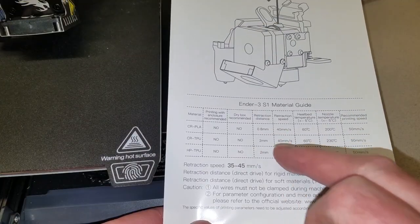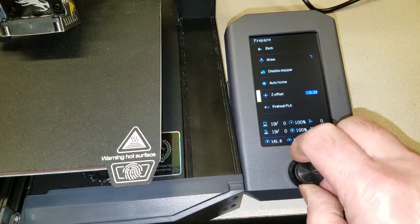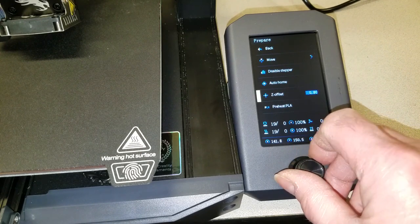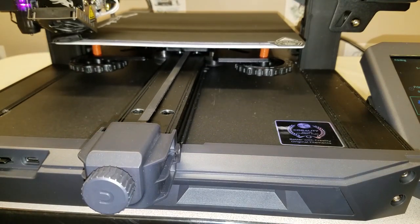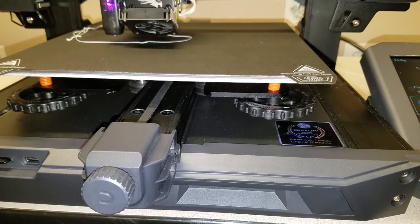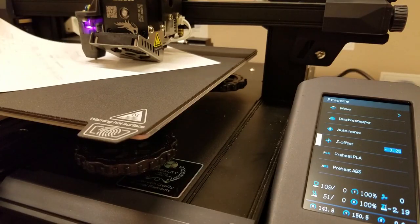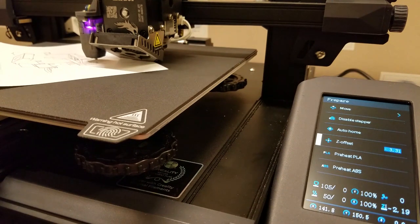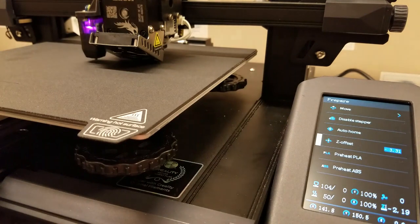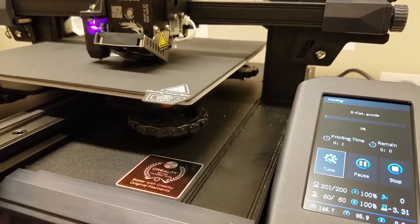Now it was time to set up the printer job. Unfortunately, I got confused between retraction, Z-axis offset, and the home position. Problem number 5: I set the Z-axis offset to the retraction distance of 0.8 mm, which meant the nozzle was floating about 4 mm above the bed when the printer thought it was close to the bed. I tried printing about 4 times, getting a bird's nest of filament each time. After more research, I learned to set the Z position to 0 and use the Z-axis offset to bring the nozzle down to within a paper thickness of the bed — about negative 3.3 mm. I set the printing speed to 50, and the printer finally did what I thought it should. In just a few hours, I had a happy cat!